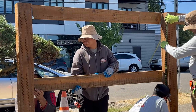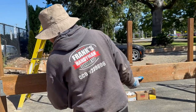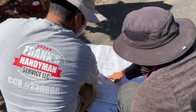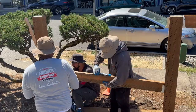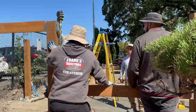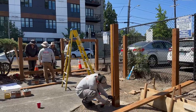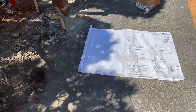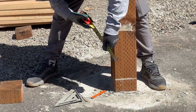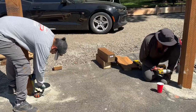The guys started to install the rails as they thought best, but when I got the plans and double-checked them, we noticed it calls for four rails. The site plan requires the rails to be two feet on center maximum — you can't have a space taller than two feet between rails. When we measured everything we'd have a lot more than that with only three rails, so we changed the strategy.